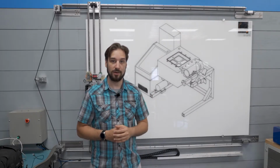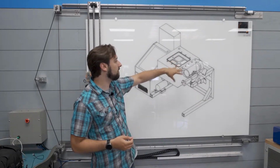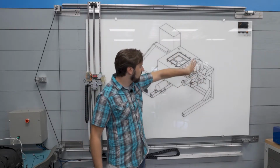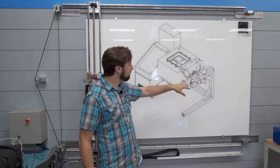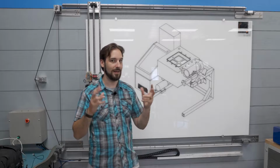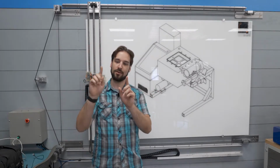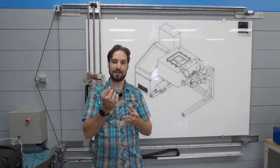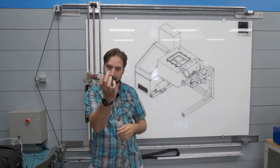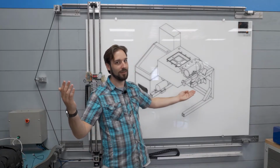And one thing that's nice about being able to run those Peltier devices backwards is that once you've finished making your ice, I've got this set up here so that this whole thing inverts, goes upside down, so that you can turn those Peltier devices to heating with this upside down, and maybe, hopefully, the ice cubes will just fall out as the boundary layer there gets melted. So instead of being frozen to that aluminum, it'll have a little bit of melted space, and maybe it'll fall out, I'm hoping. So then you could just have a plate down here and you'd get your ice there.